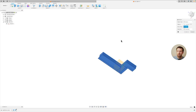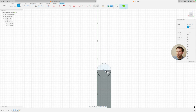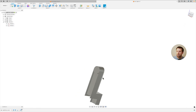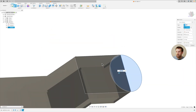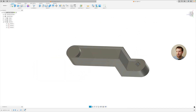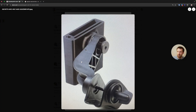Now I'm going to mirror this. If you use your imagination, you can kind of see the general outline of the part. I'm going to add the circle up here. I would have obviously measured the part in real life, but I'm just going to guess on the sizes. I'll make this solid for now. On this side, make a circle here, finish sketch, and then extrude that all the way out. I actually forgot the hole in the middle of that sketch, so I'm going back to make that — just making it five millimeters because it looks about right. Now you can see we have that basic design on this side. I've done the part you can't see — I've added the wall on the back on both sides.